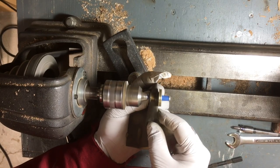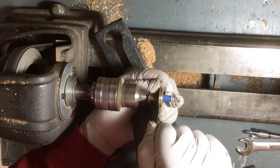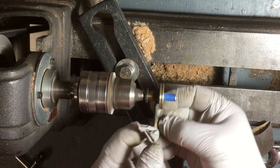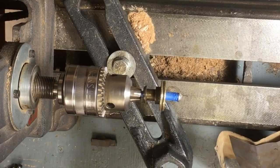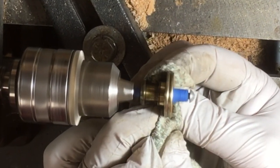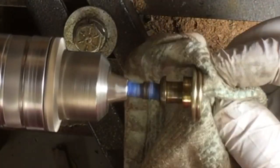Here I'm just giving a polish to the adjusting screw for the blade adjustment. I put it in my lathe, mounted it with a screw through the center and a bunch of painter's tape to give it a good secure bite. I'm just using super fine paper on this brass to give it a little bit of a shine. You can see this number two has just two ribs on the adjusting screw — larger planes will have three ribs. Everything about this plane is just a little bit more miniaturized. It didn't take much to get a nice shine on the brass.